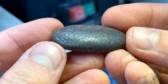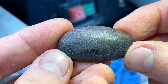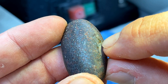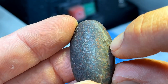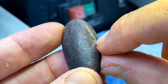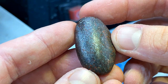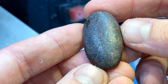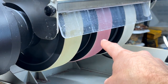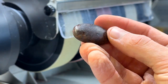We worked it on the 600 grit and it's looking really, really great — I love the iron in there that is starting to get a beautiful shine. Over on this side there are some troublemakers — it looks like it's pitting and there's a potential fracture right there. There's nothing I can really do about that, it just gives it some character. This is probably one of the closest-to-perfect pieces I've ever worked. Now we're moving on to the 1200, 3000, and 8000 grit wheels and we'll have this thing shiny in no time.